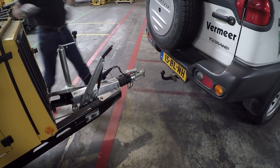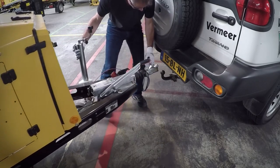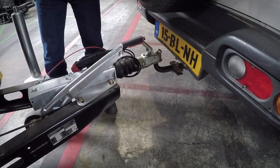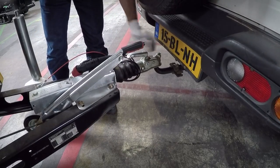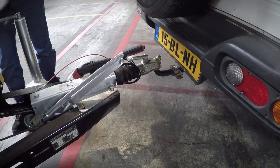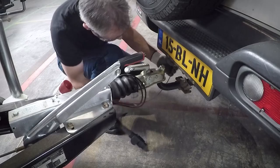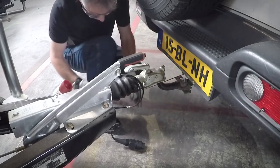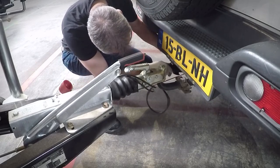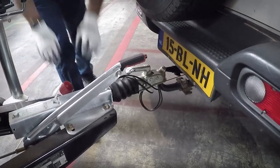Squeeze on bottom side of handle and lift to unlock the hitch. Align the towing vehicle with the hitch ball beneath the coupler socket. Lower coupler over hitch ball. Locking levers should automatically click down and lock into place. Indicator pointer on side of coupler should be in the green zone. Attach breakaway cable to the towing vehicle. Attach electrical connector to towing vehicle. Check the highway lights function properly. Push park brake lever forward to release park brake.